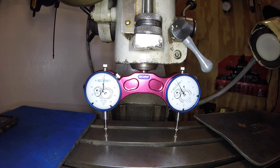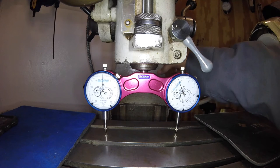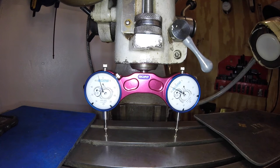Just loosen that up a little bit. Let's just adjust these so these numbers are the same. I got one-thousandths and two-thousandths — one-and-a-half and one-and-three-quarter. I think that might be about it. What it's going to do is take them both back to zero again. I find that works best instead of trying to eyeball it up.